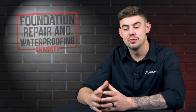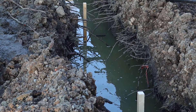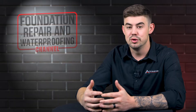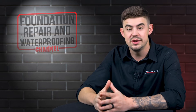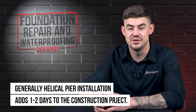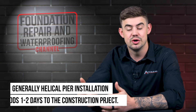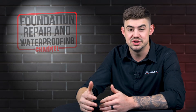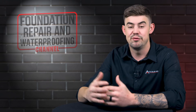When we're doing Helical Piers for a new build, this is happening before the foundation is actually poured, so this can be done very quickly. We're putting those in after the foundations are dug, prior to them being poured. A majority of the time it only takes us a day to come in and fully install those Helical Piers before the foundation's poured, so you're only looking at an extra day, maybe two days, of your overall project — and we can install high quantities of piers beforehand.